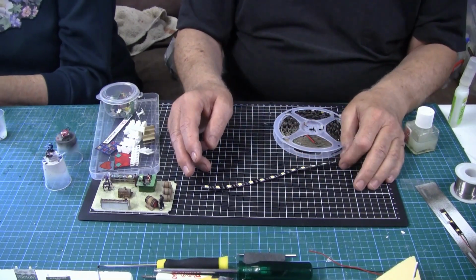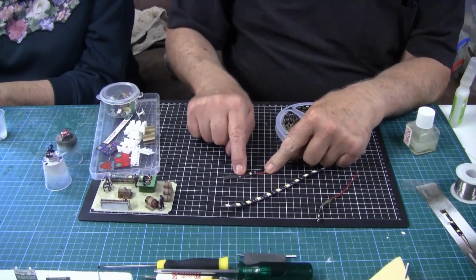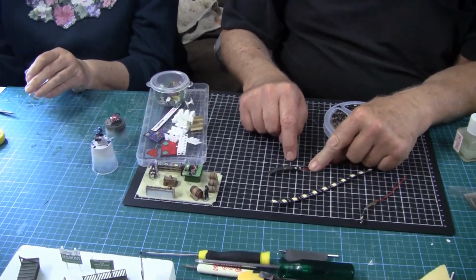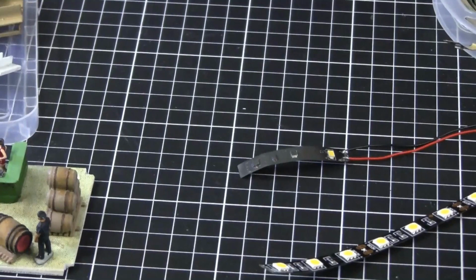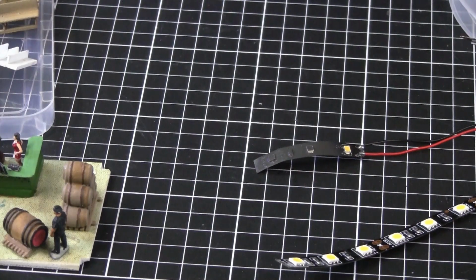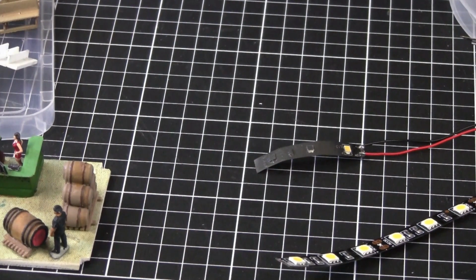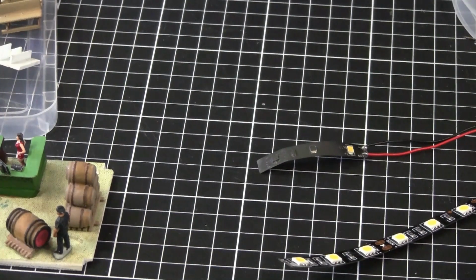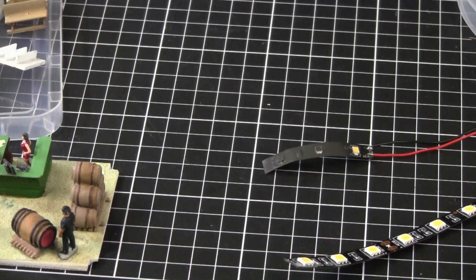And I'll also run them at 9 volts. There's an example of a unit with 2 of the lights painted out, and only 1 light used. There's a little bit of a glow through the black paint for the others, but it's inconsequential. So, simplest way to do lights. Of course, there are always cases where you need a single light for a particular reason. Then we go back to the good old single LEDs, and the need to convert the 12 volts down to somewhere around 3 volts, depending on the LED.